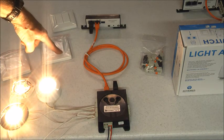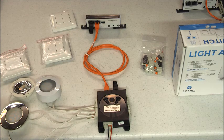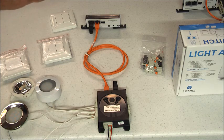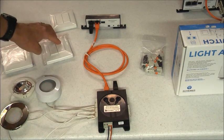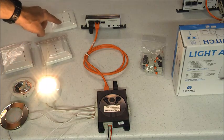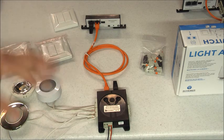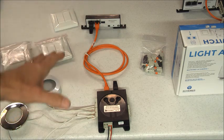Let's also program a whole-boat switch. I go back into learn mode, go to channel 1 and assign this switch as on and off, then channel 2 with the same switch, then channel 3 the same. After cycling through channels four, five, six, and pressing seven to exit, I can now turn all lights on at once and turn them all off with one switch. This is useful for security situations or, for example, turning on all the boat's lights from the companionway with one touch.